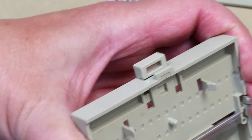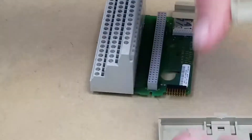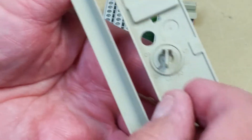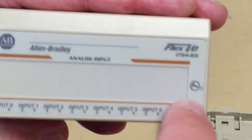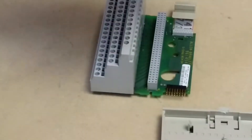Here is the base that goes on the bottom. There's your locking mechanism. Here's your grounding plate. This is your third piece, which is where your switch is. And this only rotates in the one direction. This will match up with — if you look on every module, you'll see on this side a number. In this particular case, this is off an IE8 and it shows a three. That means this keying switch needs to be set to show a three. That's all pretty simple.